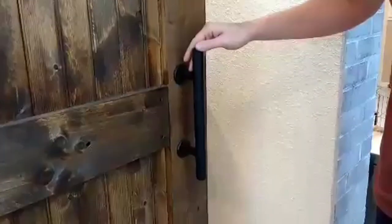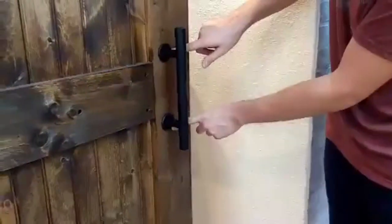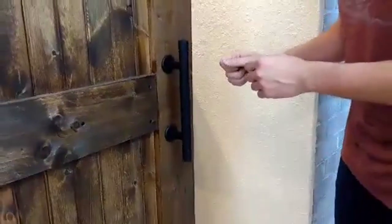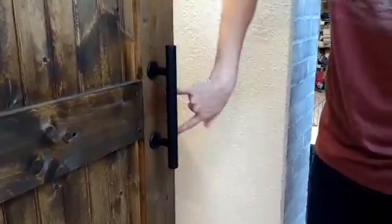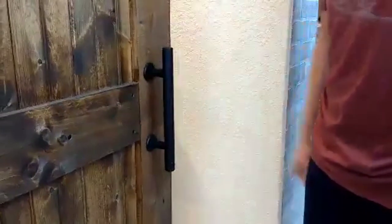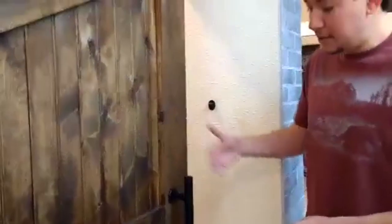The handle we decided to mount on the door. One tip for mounting these, especially on a thick door: it's incredibly difficult to match where the hole should go for your bolts, and when you're drilling you have to be especially careful to make sure you're going 90 degrees into the board. Because if you have any angle on your drill, by the time you get to the other side of the door, your measurement won't be accurate and the bolts won't go in on the other side. Make sure your drill goes straight in, perpendicular to the surface. I also recommend starting with a smaller drill bit to prevent drift — in this case I used a sixteenth of an inch and slowly worked my way up to the three-eighths inch required for the bolt.